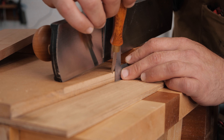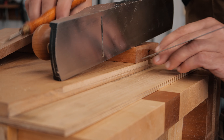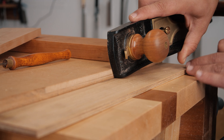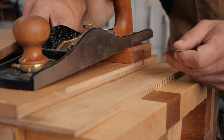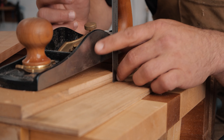You can see this lighter-colored wood — that's where it has been cutting — and that's okay, because you never lose that reference. The plane always rides against that reference area and will never change the angle of your shooting board or the distance in which it can go in.